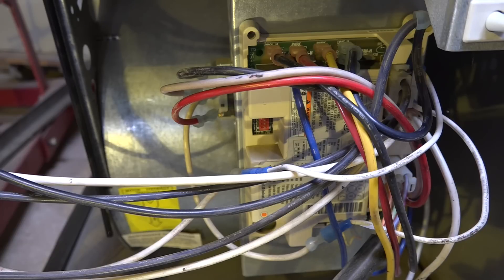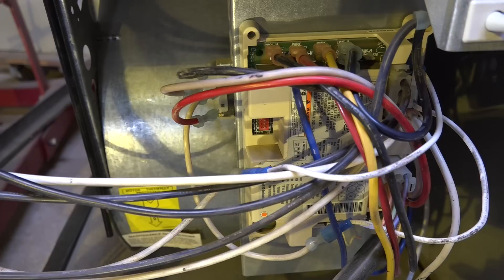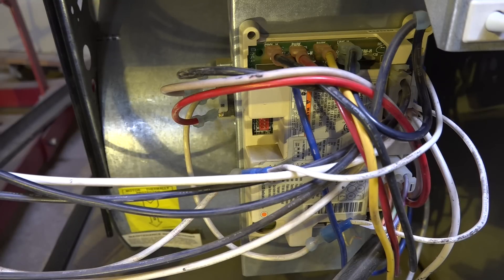What we're going to show next is the time delay for the blower to shut off. You have a fixed time delay before the fan came on when the burners came on — that's fixed, you can't change it. The time delay on the off-cycle of the blower is adjustable. The reason it's adjustable is you don't know how restrictive the duct work will be for whatever this furnace is hooked up to. More restrictive duct work may take a longer purge time to cool off the heat exchanger, and less restrictive will take less time. So what we're looking at here is a set of dip switches.